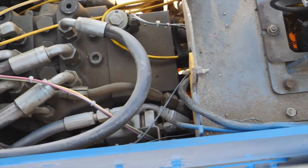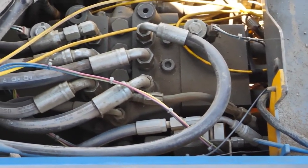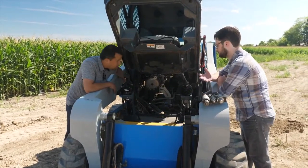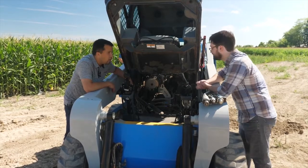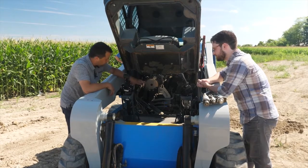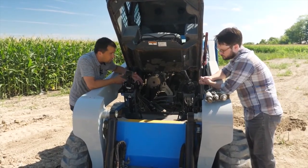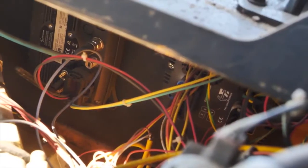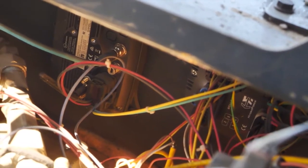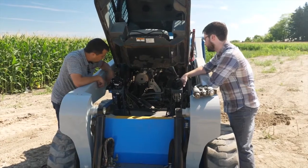So that's essentially this large valve assembly down here. And this entire thing is really the heart of the machine when it comes to the boom and bucket functions. And then the auxiliary also has really good control, it's just not being used. We don't have anything to run it today. And the electronic portions that we were operating, say the app and everything, is coming through some controllers that you guys have on here. Yeah, that's coming through our EROW, our telematics unit, which is right behind the panel in the middle there. And then our ECU itself is immediately to the other side of it, and that's controlling the valves inside the block.